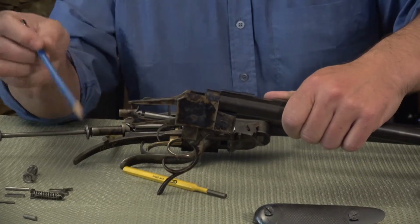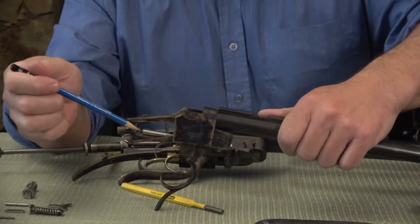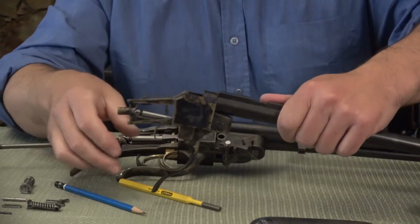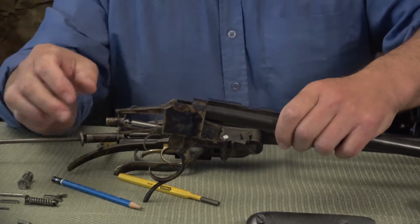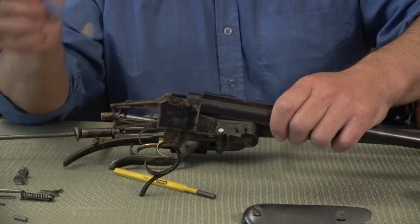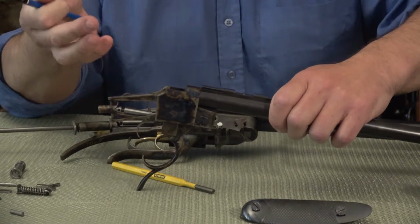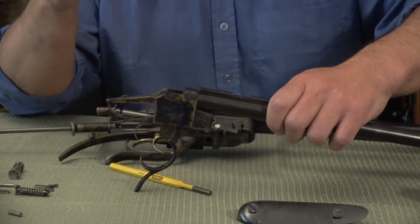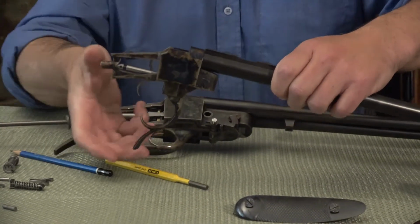So there's a spring in this shroud that you can't see. It's quite a strong spring, and that pre-tensions the block. So if I shake this, there's no feeling of a mousetrap. That's the best way I can describe a lot of these old English falling blocks. That isn't to take away from them. It was amazing that they got them to work. But there are springs and countervailing springs and pins and so on. There aren't any pins visible on the Hagen.